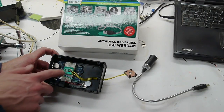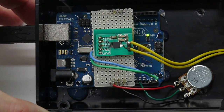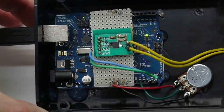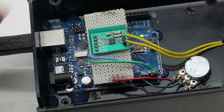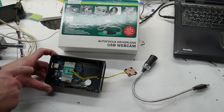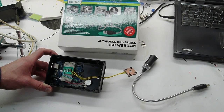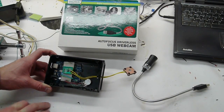The nice thing is that the chip doesn't require very many external components — just three capacitors. One downside is that the chip only works with I2C. You can't really just give it an analog voltage or send it a serial or parallel data signal; it has to be I2C. So I'm using an Arduino just to send it the I2C data. Someone wrote an I2C library called Wire for Arduino, which is why I'm using it, and I didn't really feel like learning about I2C for this.